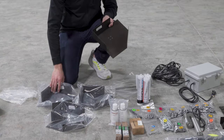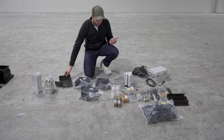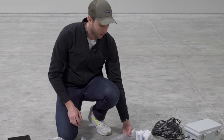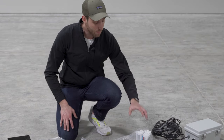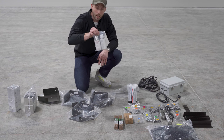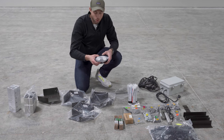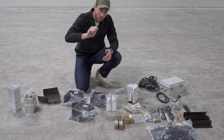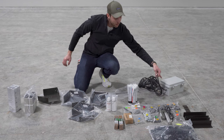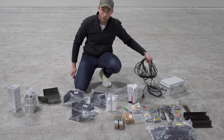For the small parts, you'll have gutter connectors — four of them, drilled and labeled for electrical and drainage, with two labeled standard. The motor connect piece is used at the very end to connect the link bar to the motor. You also receive tubes of caulk to seal the unit, touch-up paint either as a spray can — shake for 10 minutes before use — or a touch-up pen. The electrical box houses the electronics: a 9-foot 110-volt cord on one side and landscape wire on the other that connects to the motor, with 50 feet of line included.